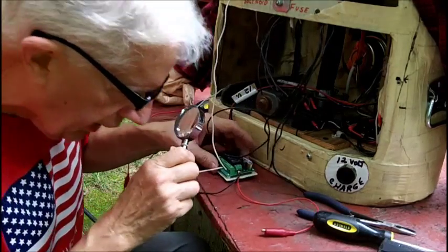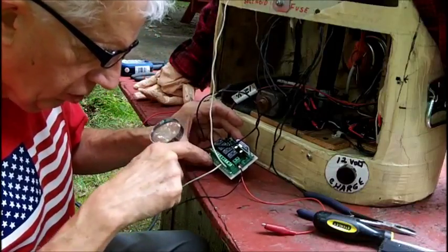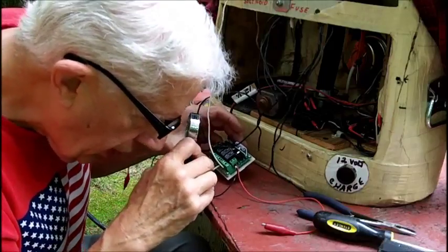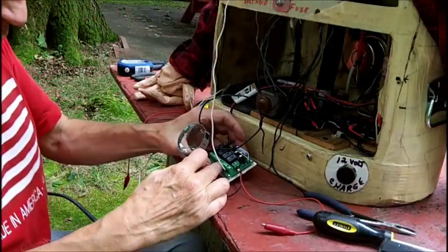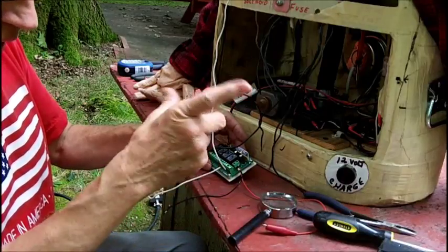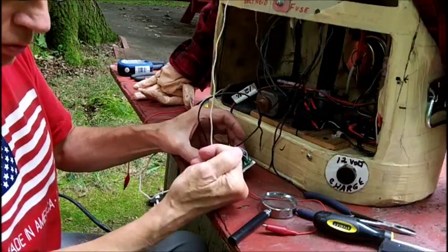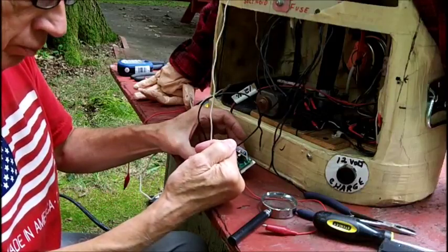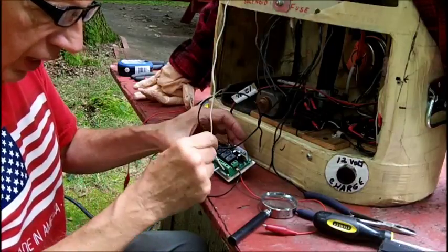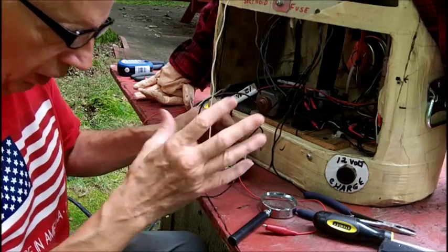Okay, so I can't show you a close-up, but there's 4 relay circuits and 3 screws for each. A and B, from what I've traced out, is a switch, basically an on and off switch. The way I got these is, as long as you hold the remote control button down, it will stay energized. You release the button, it'll de-energize, and that's what I want.